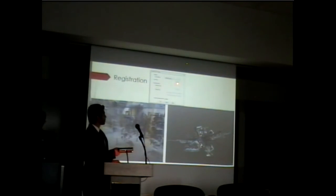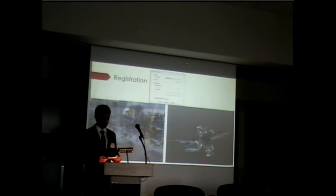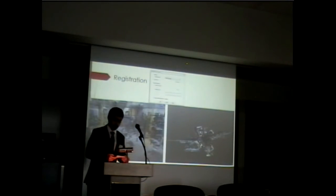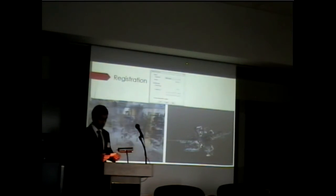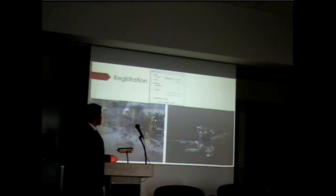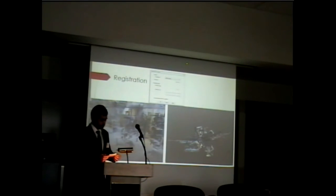We choose the resolution of 0.01 millimeter, which means a point will be visualized at every hundredth of a millimeter. After applying this step, all the scans will be overlapping one another at the centroid of the project. As you see here, we have the same wall 3 times in the same picture. This is a picture from the outside of the point cloud, showing the overlapping of all the stations that we have. So this is where the next step of registration begins.